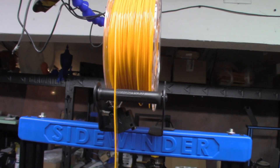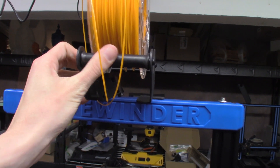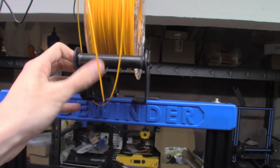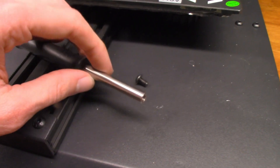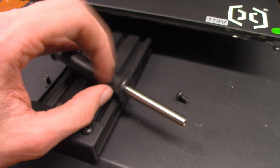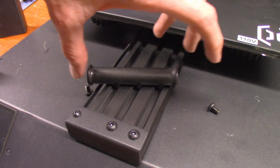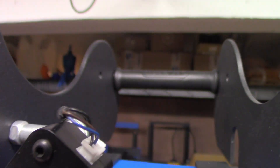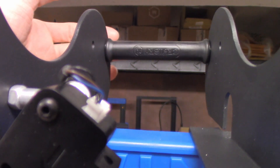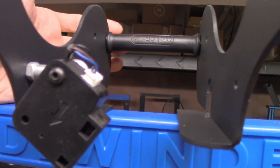Now that we've got that taken care of, there is still a bit of friction with the spool, so I'm going to look at these rollers and see if there's anything we can do to make them move a little smoother — maybe a little grease. I think I figured out the problem. Artillery actually has a really nice ground rod here — very smooth — and the inside is smooth as well. But the problem is there's a little bit of play back and forth. It spins quite nicely by itself, but the moment it starts rubbing up against an edge, it has the tendency to bind.